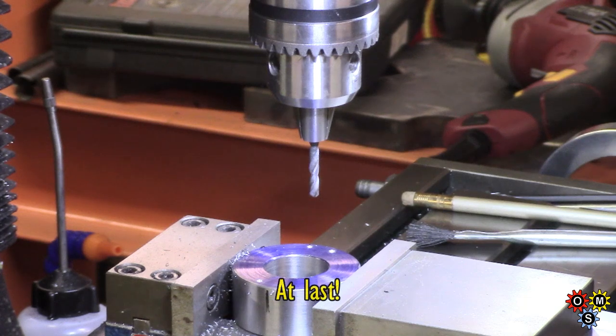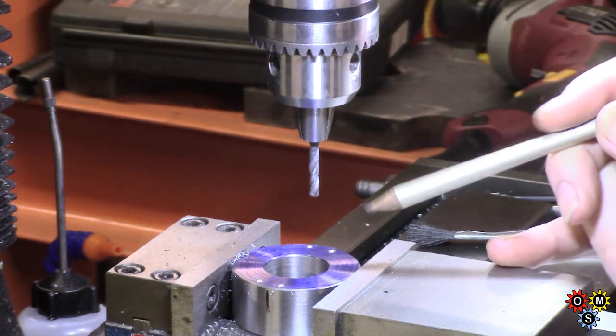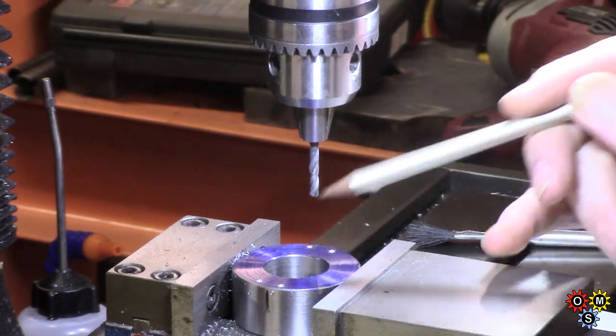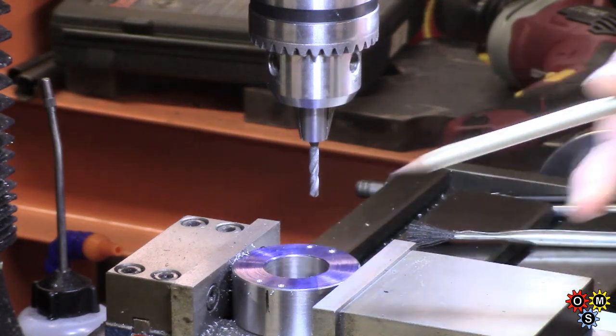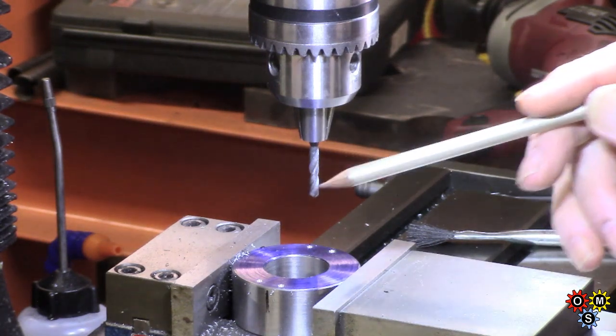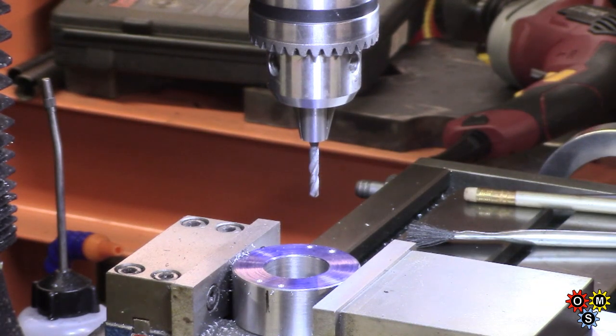Okay, mill time. The roll pins on the back of my spindle, they were put in long ago. They're not actually perfect for position in terms of symmetry, but anyway, I managed to get sufficient marking on the blue to get somewhere to centre pop. I put a centre drill down and I've noted my coordinates, and the pins are 1/8 inch, and I've got a 5/32, I think. I'm just trying to remember. I'm just drilling slightly oversized, so I'm hoping this will go on easily.